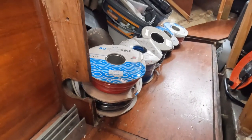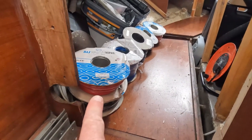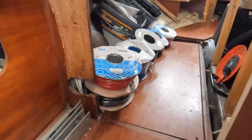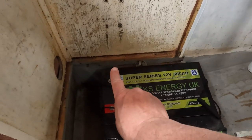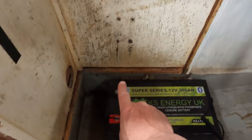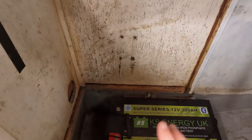The battery wiring is all stacked there, and the cable we're using for all of the 48 volt system is this enormous 95 millimetre squared cable, which is nearly two centimetres in diameter. That will be coming from these batteries through a watertight gland in that bulkhead, via a switch for each battery bank, to a busbar.